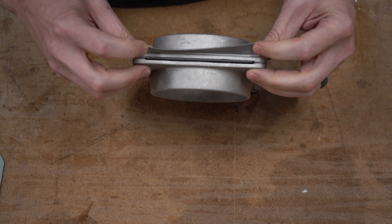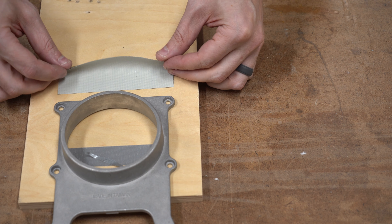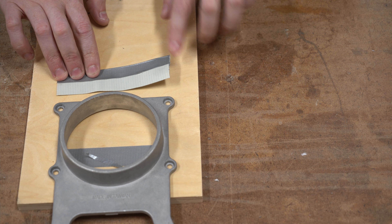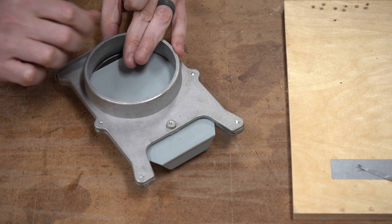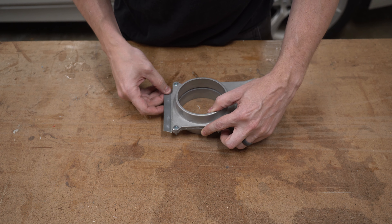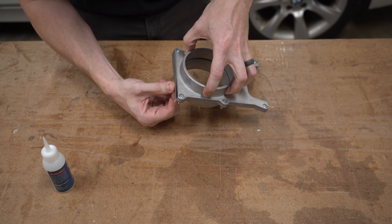The thought here is that when the suction's coming through, the duct tape will suck into the gap, clogging it and sealing it off from the air escaping. When there isn't suction and you close the gate, it will allow any dust to escape out the slot. This may not look pretty, but it's a pretty ingenious solution. The only issue I noticed was that the tape naturally wanted to stick the flap out, and over time it had a hard time staying down when the gate was open. So to fix this, I discovered if you add a little tab up top and fold it back down, it makes the tape naturally want to stay closed — making it closer to the gap to clog it easier — but it will still open when the dirt needs to get out. In a few cases where I didn't make the tab big enough and it wouldn't stay adhered, I just added some more Starbond CA glue, and that kept it in place. Flap stays closed when the gate opens and allows dust to get out when it's closed.